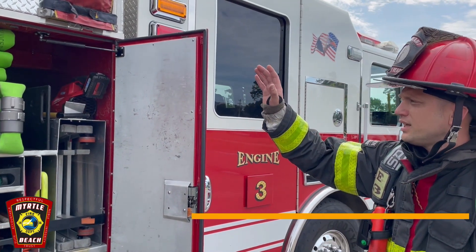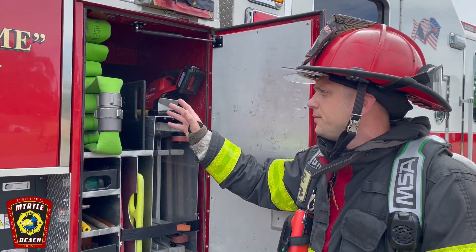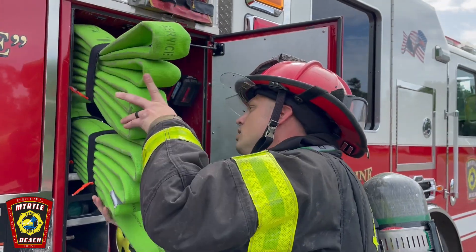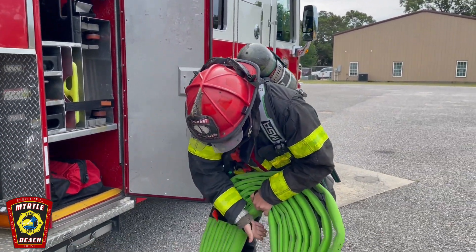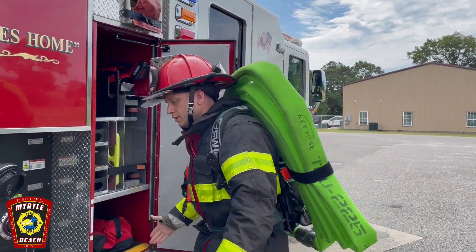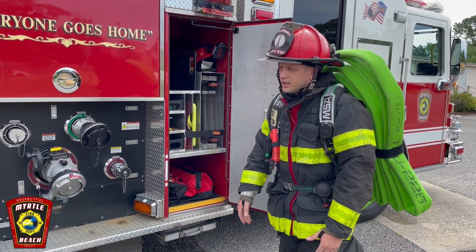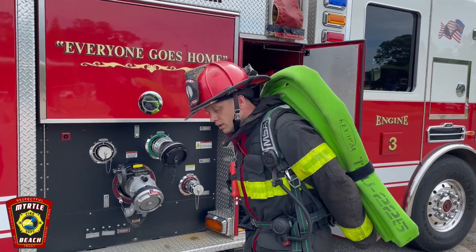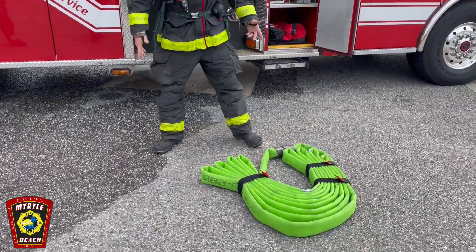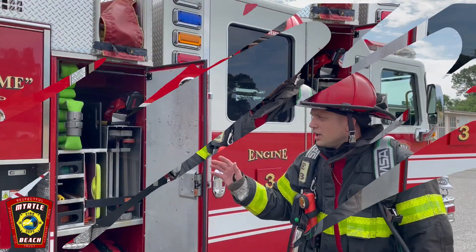Here's how to take the bundle out of the compartment and put it on your air pack. Both the officer bundle and the firefighter bundle will be located in this compartment. Pull the bundle out, find the split where your cylinder bottle is going to go, throw it over your head and drop it down so it'll be on your air pack. It leaves both hands open for tools, a water can, an officer bag, or whatever else you decide to take on a high-rise. To get it off once you get to your landing, just grip the bottom of it, give it a little push back, and it comes off easily. From there, undo your straps, undo your coupling, and flake it out.